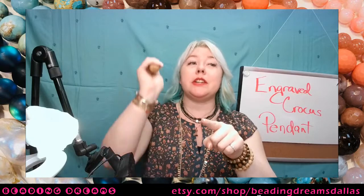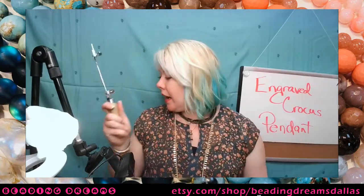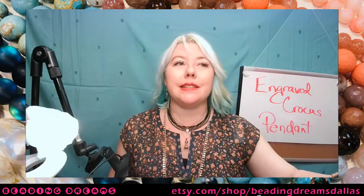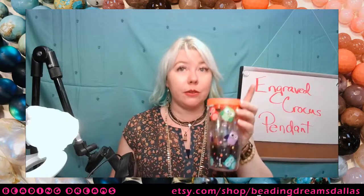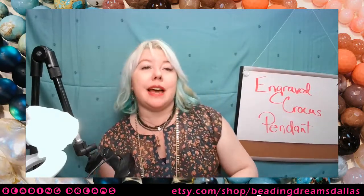The problem is when it jumps forward and you're in a downstroke, that's the way the teeth cut. And yes, that is why I had a tetanus booster 7 years ago, because I sawed the hell out of my left index finger. So just be careful when you're coming to the end of a cut, because your saw blade at that point is going to leap forward rather aggressively, and it's better not to have your fingery parts in front of it.